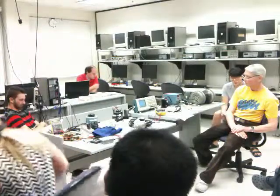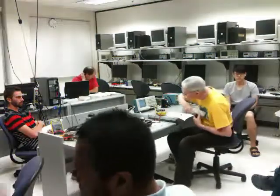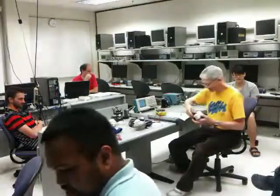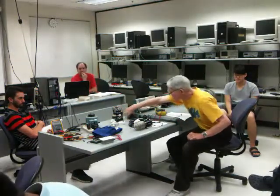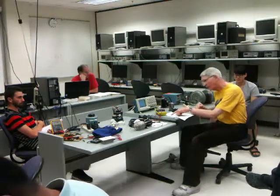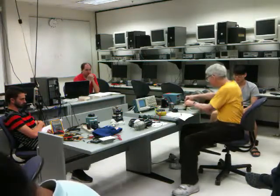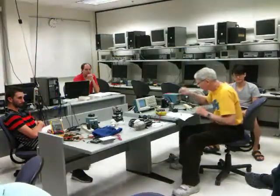Now, how about a capacitor now? 40 microfarad capacitor. What would that look like? Not this one, it's too small. Probably looks like that. If you do that, you're going to get the power factor that you want. Here, we're going to try a capacitor, and isn't that what we calculated? Okay, now plug in this capacitor.